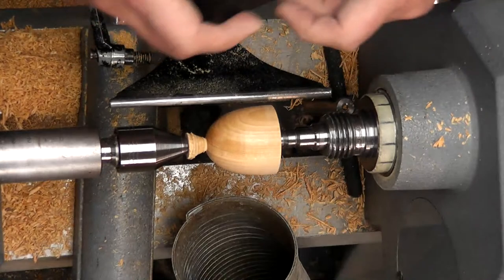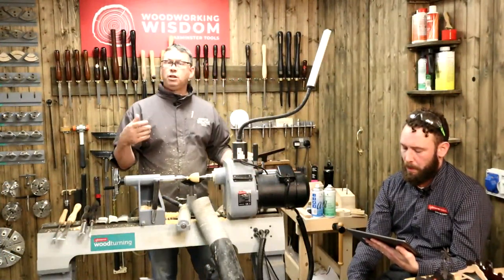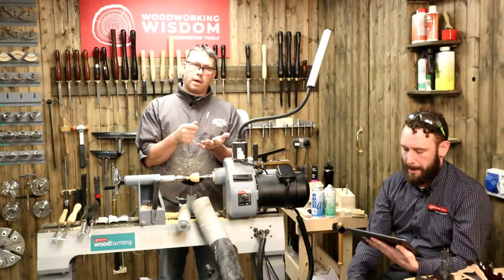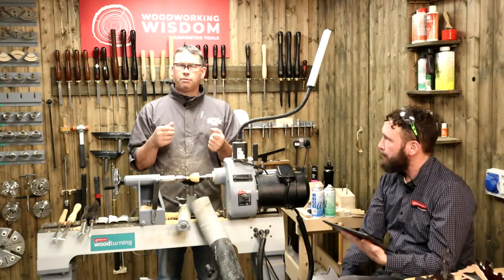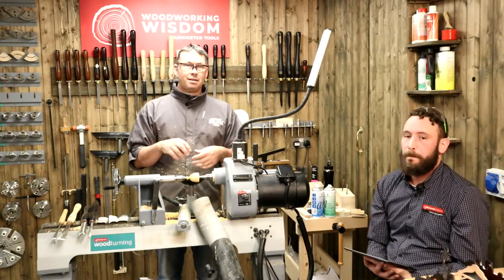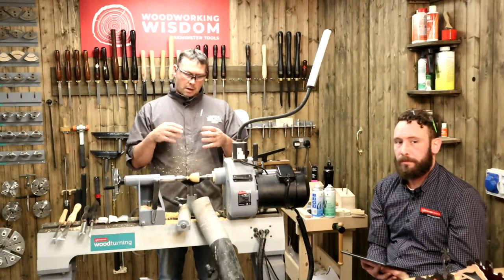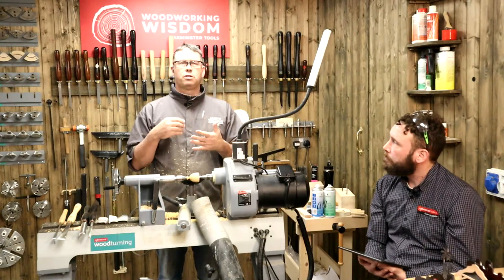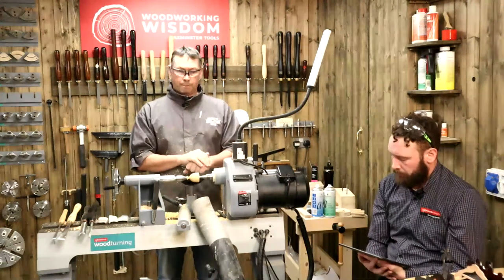And honing. So honing with a leather strop, again, you can do that off a machine. You can just get a piece of leather and use some honing soap to do that yourself. And honing does make a big difference, not only for removing burrs, but it gives you a longer lasting edge, especially on the lathe. Wood turning tools have to put up with a lot of pressure. So if you can get them honed to a really sharp edge, they'll last you a lot, lot longer.